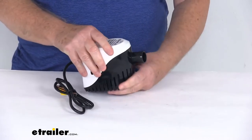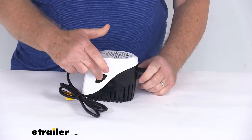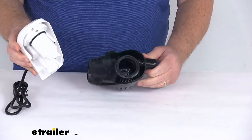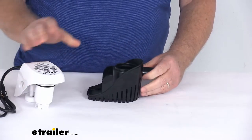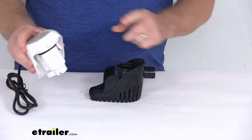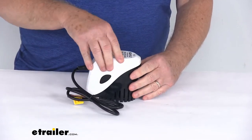The strainer on the bottom base will easily remove from the base for cleaning. You can see the black button on this side and one on this side — just push those and lift up to remove the pump. Your strainer base remains in place, so there's no need to disconnect the base or the plumbing. This is where your hose will attach when replacing the pump, so the base can all stay in. Then you just slide the pump on and snap it into place.